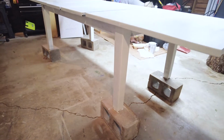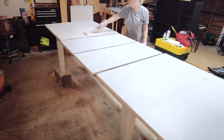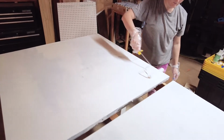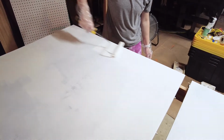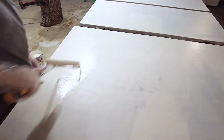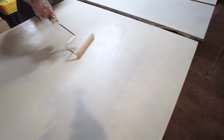After painting your table, you want to allow enough time for the paint to cure before using it. Don't set anything on your fresh coat of paint. Remember, there's a difference between dry time and cure time. Check on the paint can to make sure you don't mess up your new coat of paint. Not putting things on the table is one of the only reliable ways to ensure your painted table surface cures properly. You will most likely need a second coat of paint.